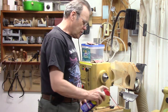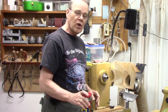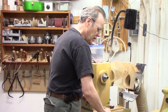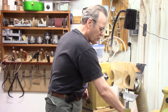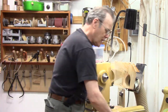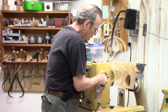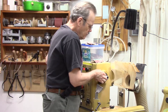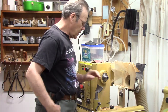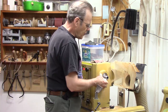I got this tip from John Jordan, a very noted professional wood turner and wood artist known for his hollow forms. This is a tip he demonstrates when he demos, because he does maintenance on the lathes he's going to be demonstrating on. If it's good enough for John, it's good enough for me. I also like to wipe along the face of the spindle, then just use a piece of paper towel to wipe it off a little bit — that'll keep your chuck from sticking.